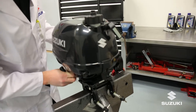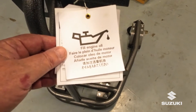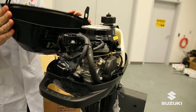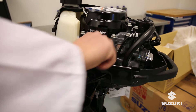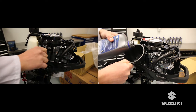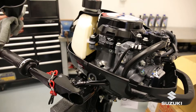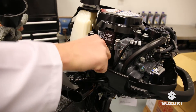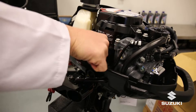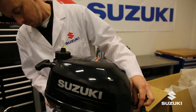Keep as level as possible. All Suzuki Outboards require 4-stroke engine oil being added before starting. Once the cowl is removed, add the correct measured amount of high-quality 10W40 Marine 4-stroke engine oil to the crankcase. Reinstall the yellow plug until snug. Reinstall the cowl and properly secure.